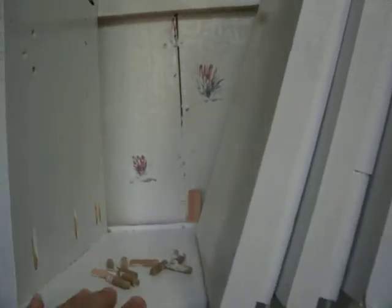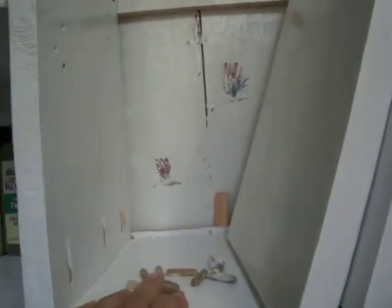The living room is on the other side of this room. But because this is an 8-foot run of shelving, I went ahead and put a third brace in there. And you can see I used the pocket holes. So the shelf here is supported by this, but it also supports the base shelf with these pocket hole screws.